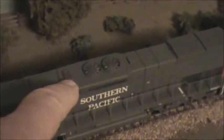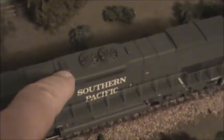Well, the SD45s, of which SP had about 360, had a problem in tunnels and snow sheds of overheating. The exhaust on an SD45 is right here. This is an SD45 T2, but the exhaust on an SD45 is in the same location as on the SD45 T2. And then the cooling radiator fans were back here, and they pulled the air down and vented it out the sides of the grills on the SD45. And so they're pulling hot air right into the cooling system on the SD45s, and they're causing the engines to overheat and shut down. So the tunnel motor design, this is an SD45 T-2.